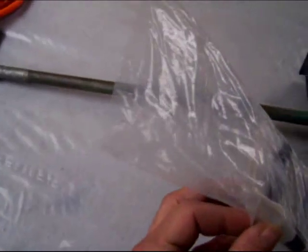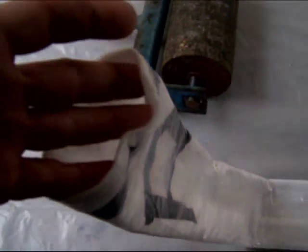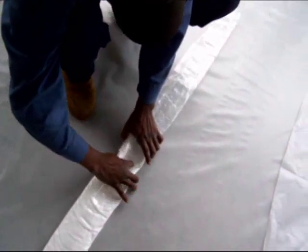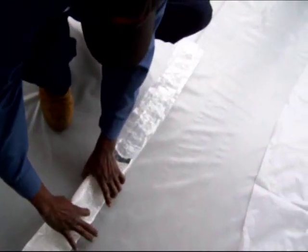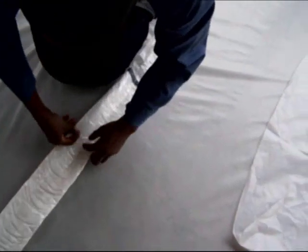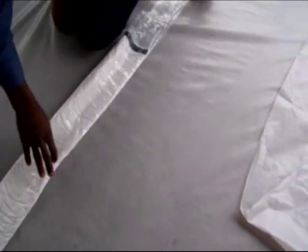On the pull end, take about 2 feet of release plastic and slide it over the end of the liner until it is flush with the end of the liner. On the air end, you'll want to take approximately 2.5 to 3 feet of release plastic and slide it halfway onto the end of the liner. This will catch the excess epoxy after wet out.